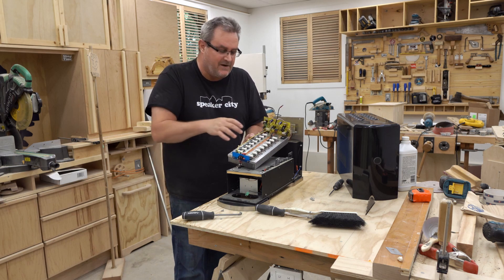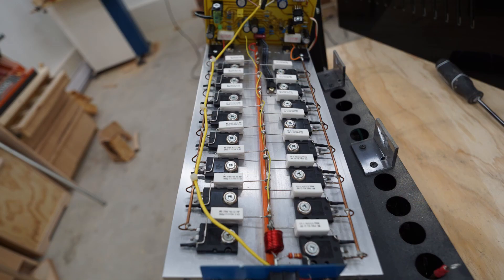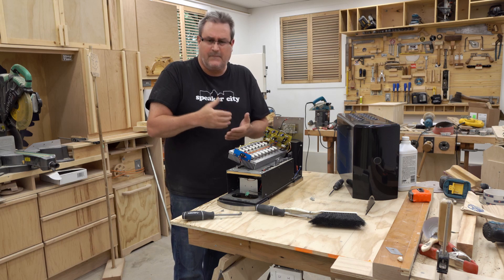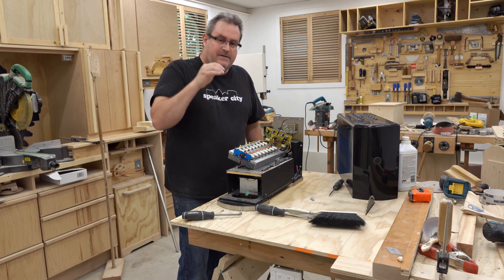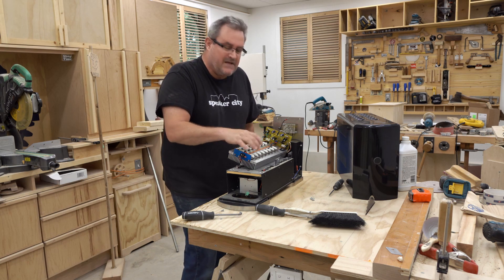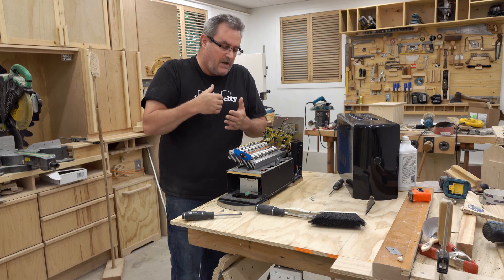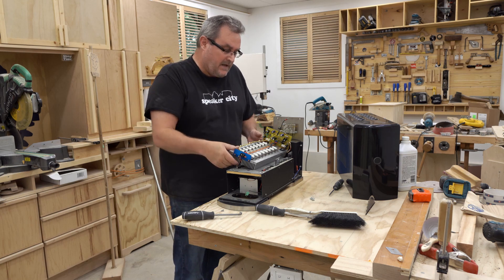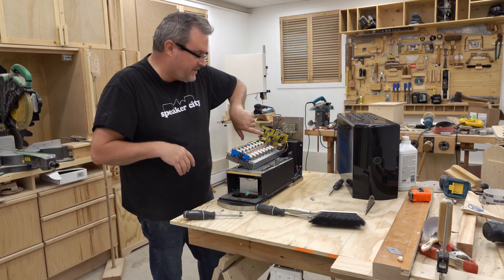When this is on and running, these halves of the heat sink are electrified, and I've got an orange strip of plastic in between glued on with silicone — that's what isolates them from each other. With a typical power transistor, the back panel is conductive and is usually attached to the collector. Instead of using the collector pin, I use the back panel, which gives the transistors better contact with the heat sink and releases heat a lot quicker. As you can see, there are quite a few of them here.